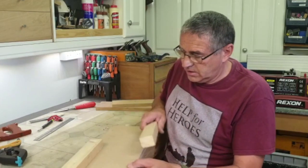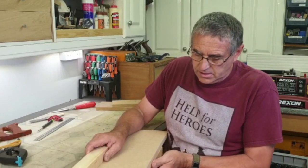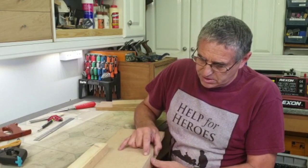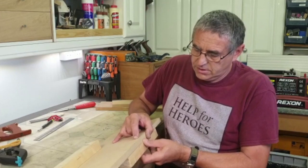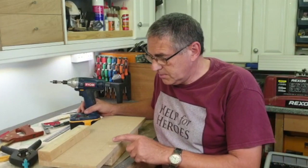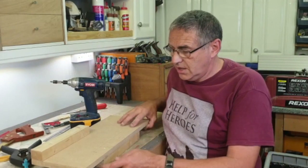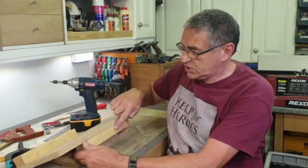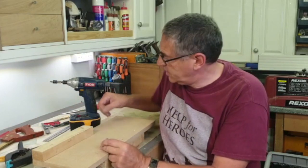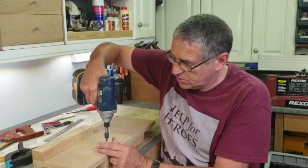And we will now put the actual hook on the back of the board using exactly the same method. The hook for the back sits underneath and approximately halfway along from this point. So wherever this point meets, halfway along, so that we're looking about there. And that should work nicely. As you can see, we're now going to be dropping the remaining screws in the hook side, which we've fitted. So we're just propping that up on some timber, keep it nice and square, and we're just going to pop these screws in. And they will be the last 2 screws on that side.